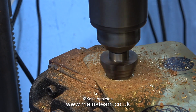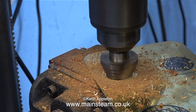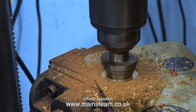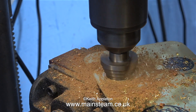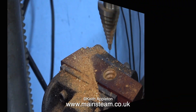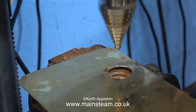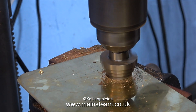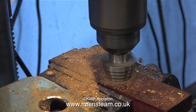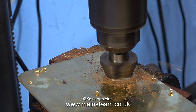It's now time for a serious health and safety warning. I'm holding this brass plate in my hands — yes, I've removed all the sharp edges, that's common sense. I feel the need to mention that I always keep the belts quite slack on my drilling machine. They're tight enough to do the work I need, but if the drill or this tool particularly grabs — and it will grab — then the belt slips.